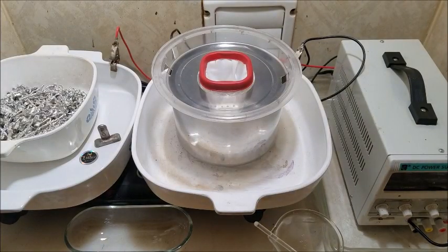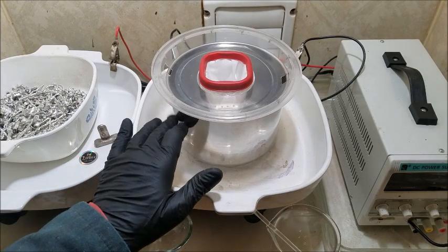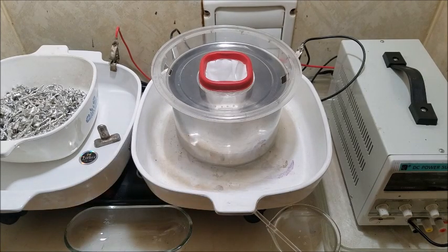But that big bowl, that big cathode, uses a lot of electrolyte. And to make the electrolyte, you need silver, and that's fine, but then you have a ton of silver that's just in solution. And at the end of the process, having all that electrolyte, you've got to cement the silver out, and then you're left with 600 grams of cement silver that you've got to work out. This way, I'm left with just a few hundred. I don't have the math worked out in my head, but let's see.